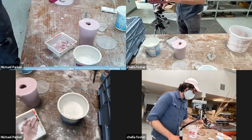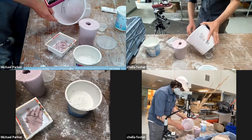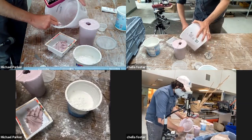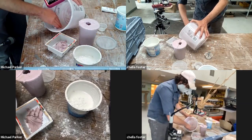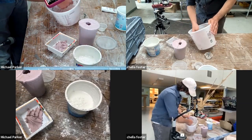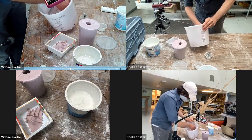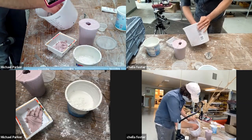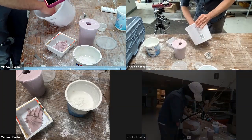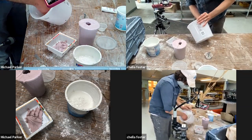We have our two molds that we're going to cast. I want to show you how to quickly clean up. This is the alginate as it's stuck — if you let this thing sit till tomorrow it becomes a real pain to clean. But if you let it fully gel up, as it has for the last 10 minutes or so, it's really easy to clean. Please, when you use alginate, clean the alginate stuff right away.